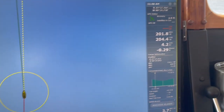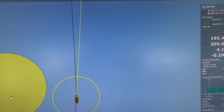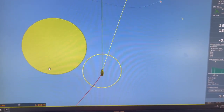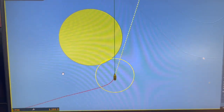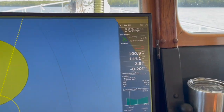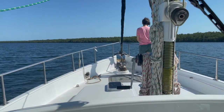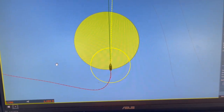Still in gear and moving forward at 4.2 knots, I'm starting my turn now, rotating into the circle. I'll straighten out the rudder and start coming into the anchor circle. Going 2.5 knots, I shift out of gear and steer into the bottom of the anchor circle. Tracy is up on the bow. I'm entering the circle now at 2 knots, then 1.9 — speed is scrubbing off.